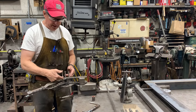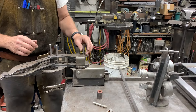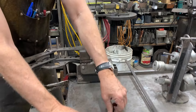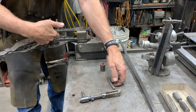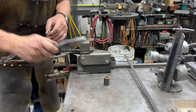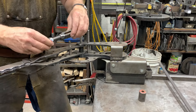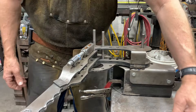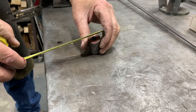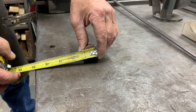I've got three pins here. I'm not going to use this setup — I'm going to take one of the pins out and use the rotary draw setup that I've made for the little bender. I'm going to put this pin in the bender and then use a one-inch cylinder, and the material will bend around that one-inch cylinder.